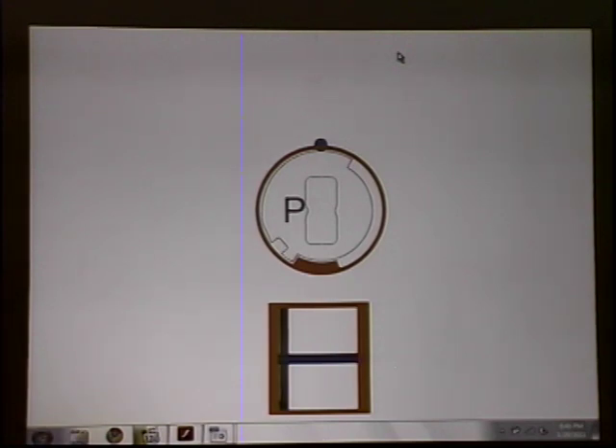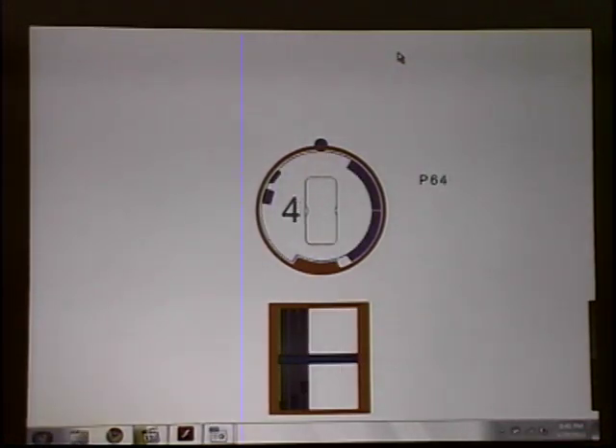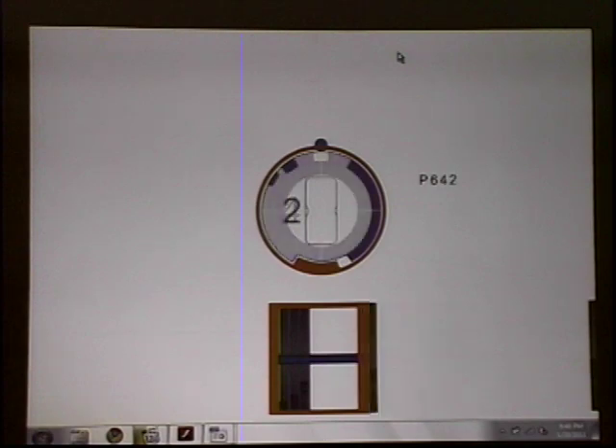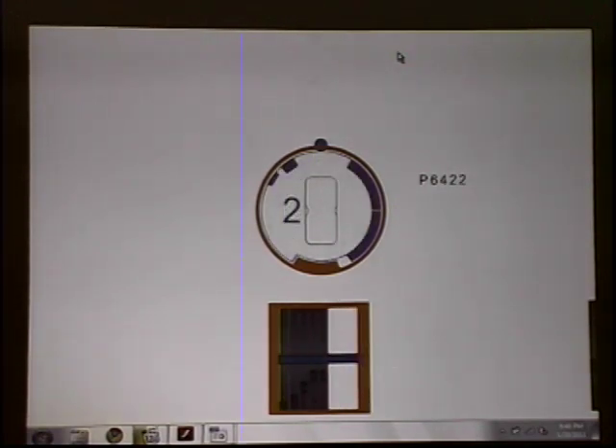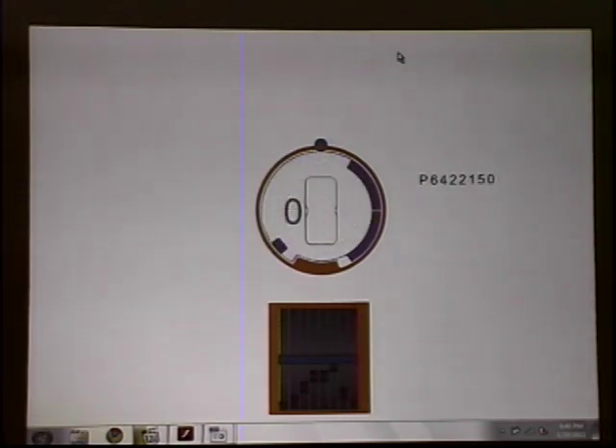Here's how it actually functions: we have our plug up here with our profile disc. We stack the discs inside of the lock — in between each disc is a spacer — and the letter/number designation on the side will actually be the bidding of the key. Once we can get access to that bidding and figure it out, we can cut a new copy of the key. They don't do anything to encrypt what the keys are, so if you have a card with your key, those numbers are the exact cuts — you can get those reproduced.